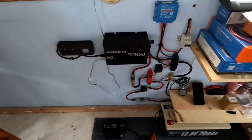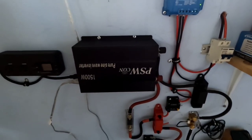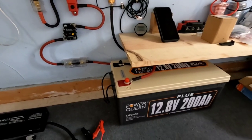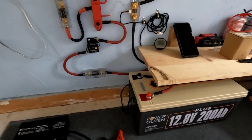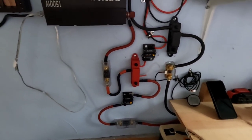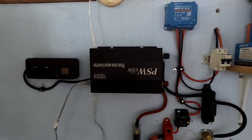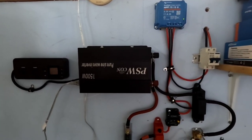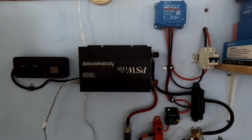I think I'm sized just about right — maybe one more 100-watt panel to get to 400 watts would really keep up given the cloudy and partly cloudy days I get here. If you live somewhere with sustained sunshine, 300 watts into this system running that refrigerator-freezer would probably be close to doing it all by itself. With hurricane season coming and power outages always a concern, keeping that refrigerator and freezer running is the priority a lot of people have.